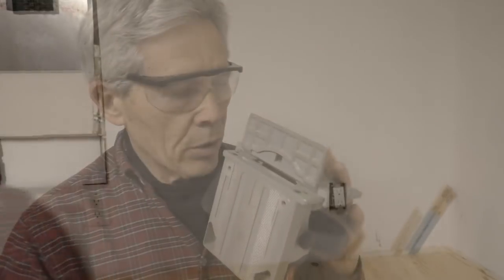Using the 20s means I have to set the gadget to where it's punching holes the right depth, which also affects the width, so that these fit in — just a little bit past halfway. You don't want the holes to be so shallow that it causes a gap when you try to put them together, but you also don't want it so deep that one side is barely connecting.